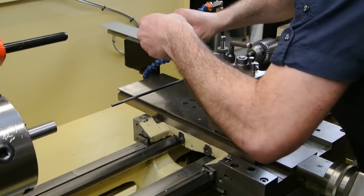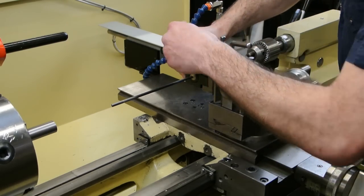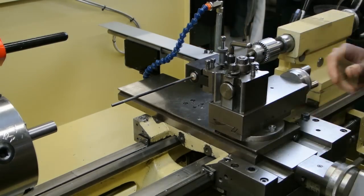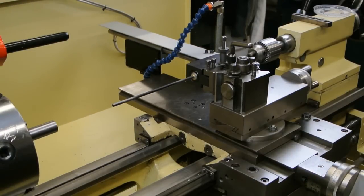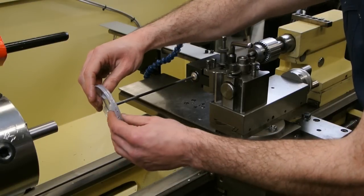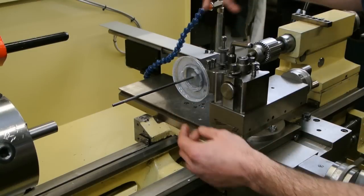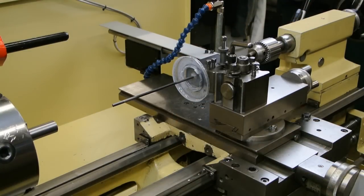This is so that when the chips are evacuated down the shaft, they are forced in the opposite direction to the machine operator. A funnel, piece of foam, or something of this nature should be placed over the front of the Ventec drill's tip and positioned against the face of the tool holder to aid in deflecting and cushioning the material chips.